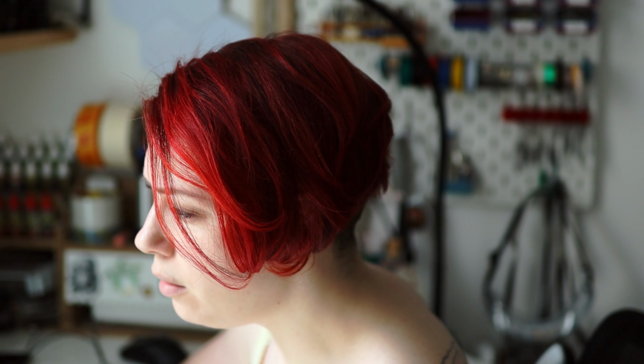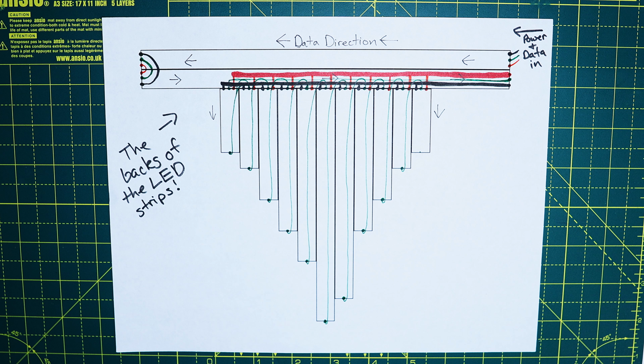Packing tape is great for sticking the strips down in the correct placement to allow for easier wiring up. And trust me when I say, anything that makes the wiring easier is something you will appreciate when you actually go to do it. Though, let's go back to the wiring arrangement for a second. I chose to feed power and ground lines into all the vertical strips from the top using a homemade bus bar instead of snaking them along from bottom to top. That said, data for LED strips does need to be wired up sequentially because it has a directional flow, meaning I had to run the wire serpentine along the length of the strip to get it to display animations correctly.